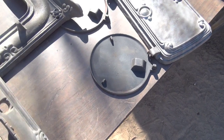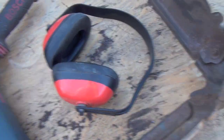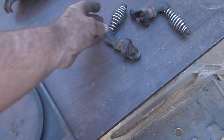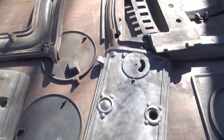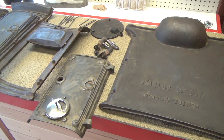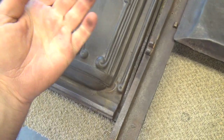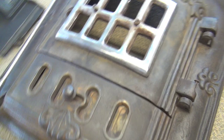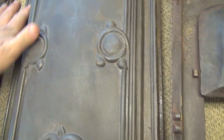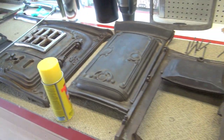Four hours non-stop cleaning and grinding. Most important thing: wear your eye protection, ear protection, and a dust mask. The main nasty, rusted, cruddy part is done. After I got it all clean, I used some SOS pads and scrubbed everything down real good. It's still making my fingers a little dirty, so I got some oven cleaner — I'll spray all these parts, let it soak for a little bit, then just hose it down. That'll pretty much strip it 100%, get all the wax off, get all the grease and anything else off, so my new fresh paint will stick.